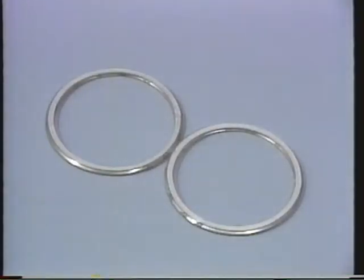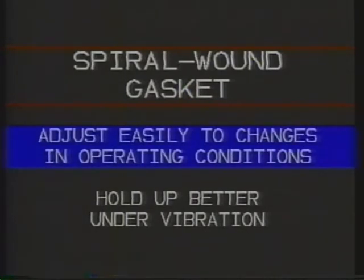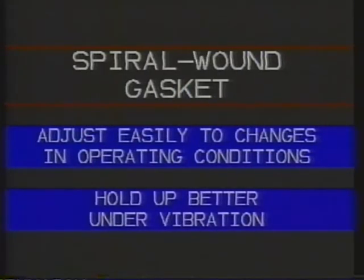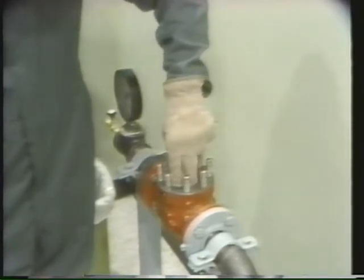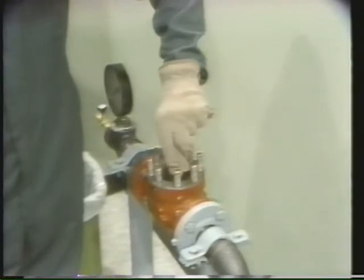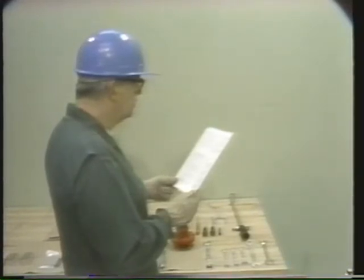After lapping, your facility procedures may call for flushing or vacuuming the valve before reassembling. Our valve has a special type of gasket called a spiral wound gasket. These gaskets are designed to have more resilience than some other types of gaskets, meaning they can adjust easily to changes in operating conditions like pressure or temperature, and they hold up better under vibration. Before the new gasket is reinstalled, the gasket surface between the body and bonnet can be wiped again using a lint-free cloth. After the gasket groove is clean, we're ready to insert the spiral wound gasket.